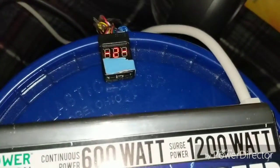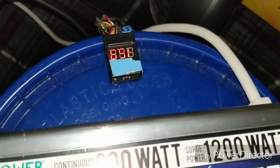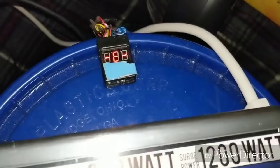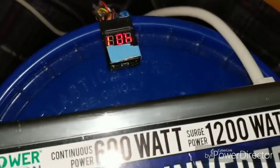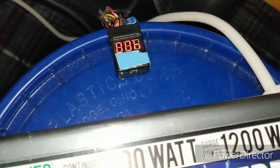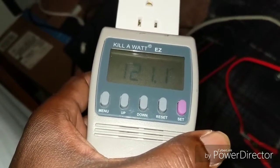I am starting off at a total of 15.9 volts: 4.01 for 1, 3.89 for 2, 4.0 for 3, 3.99 for 4. So pretty fully charged, and I'll let you know what kind of capacity I'm able to pull out after however long it takes me to pull it down.